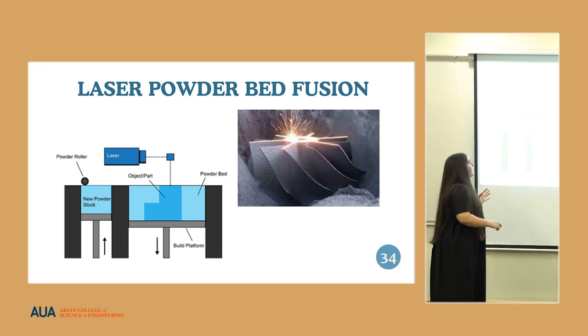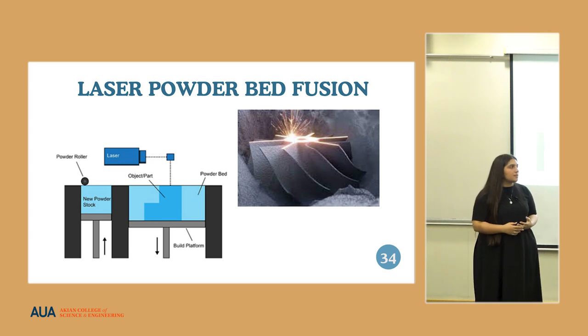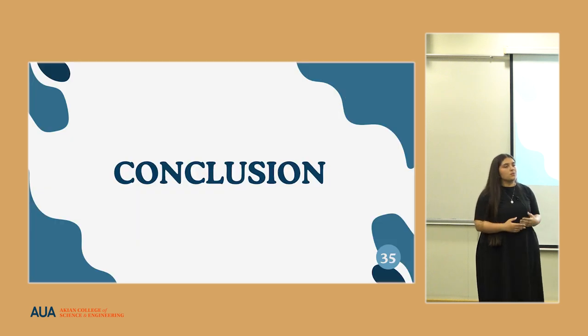Of course, this isn't enough. We also need to go through different post-processing techniques. Those post-processing techniques could include, but are not limited to, heat treatments, where we discovered a study in which they put the implant into an argon environment and were able to homogenize its surface by treating it at a temperature 100 degrees Celsius higher than the forming temperature, as well as some coatings, one of them being Gore-Tex. Gore-Tex is a type of medical Teflon which is used a lot on heart stents especially.